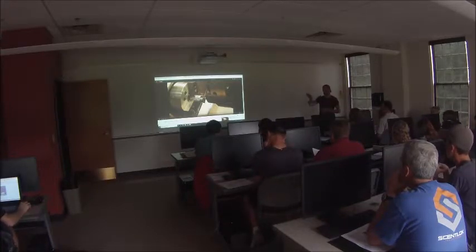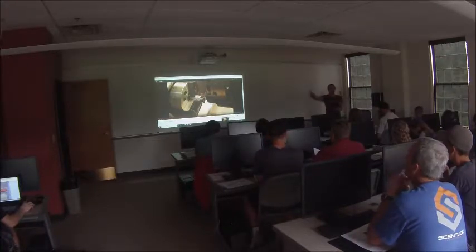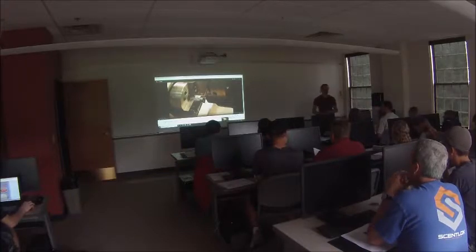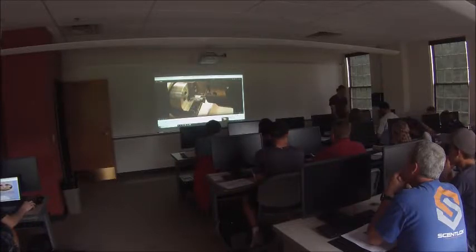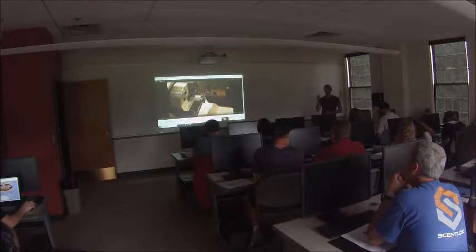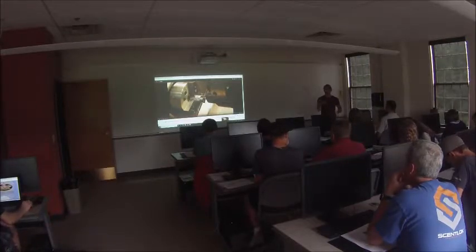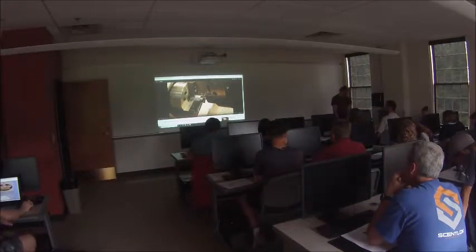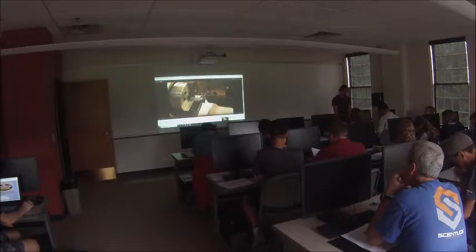And the machines are set up kind of similar to lathes and mills in terms of rotating bits and things. A lot of the most common ones, like surface grinders that are flat, they just have a grinding wheel, which is a disc, and it just goes back and forth and slowly removes material. That's a pretty common machine. But grinding, I mean, there's all kinds of grinding machines. There's grinding machines with special bits that can grind like gear teeth or like the grooves in drill bits. There's a special kind of grinder that makes those spiral grooves in a drill bit. So grinding, it's a pretty broad category. There's a lot of different things there, but that's one of them.